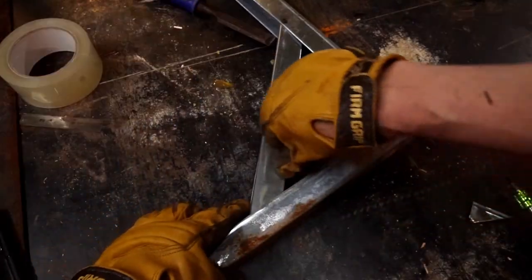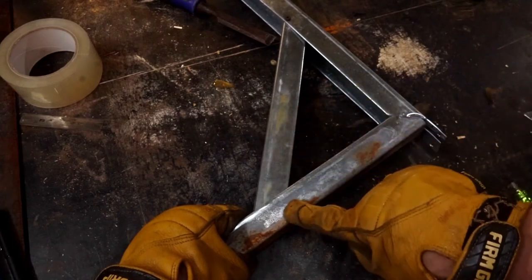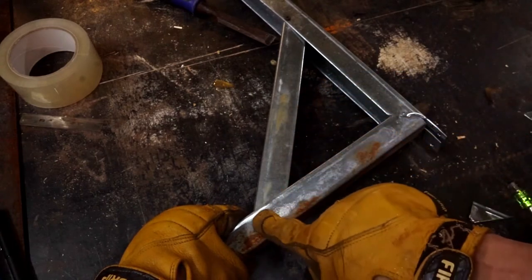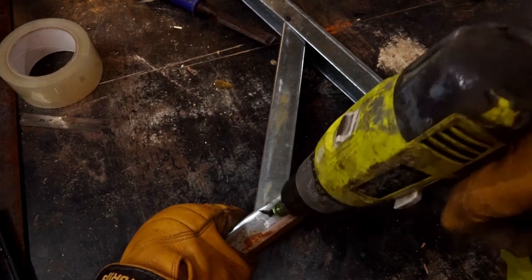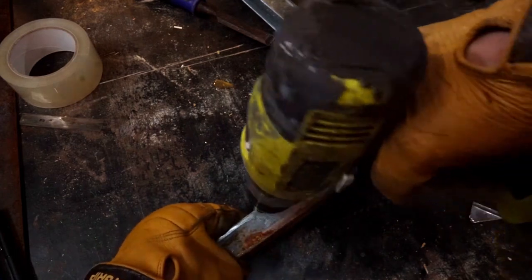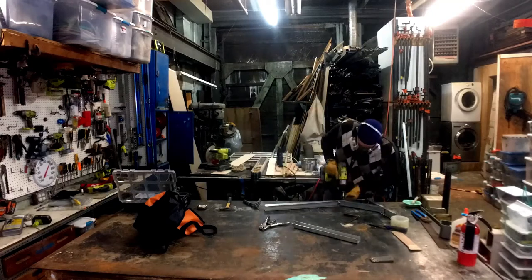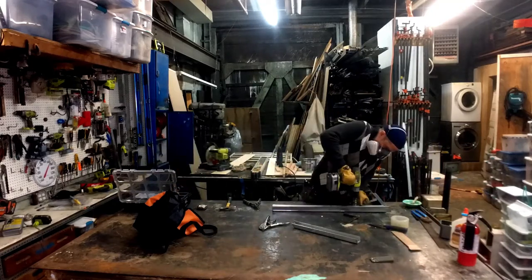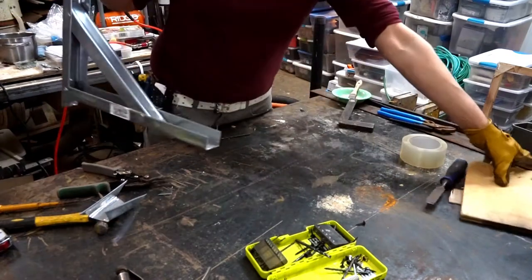Okay, now I'm going to show you this flex issue. You see the track on the outside edge? It has flexibility. You don't want to drill there. You want to drill where the track is solid. That gives you the resistance you need to go through both pieces. If I drilled on the other edge that I pressed with my hand there, it would just send the bottom track out of the way as it came through the first piece, rather than piercing them both. If this doesn't quite make sense, it will when you get to work, so you can look forward to that.